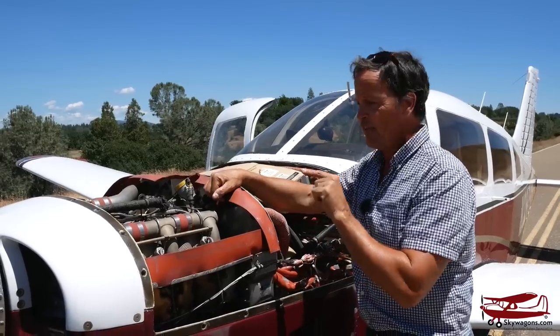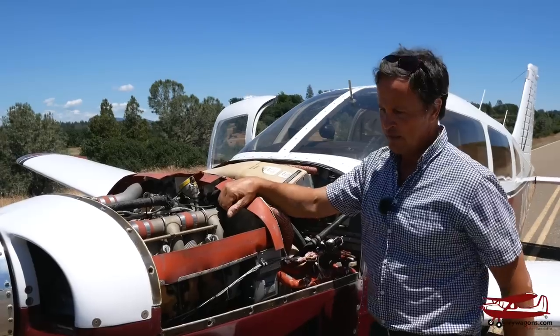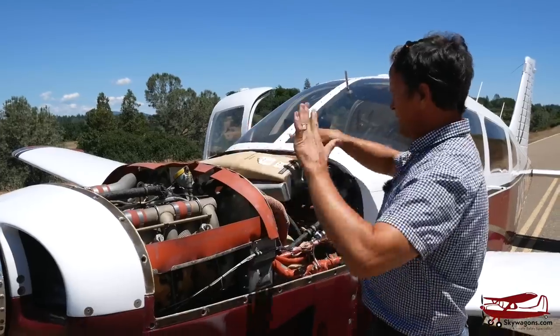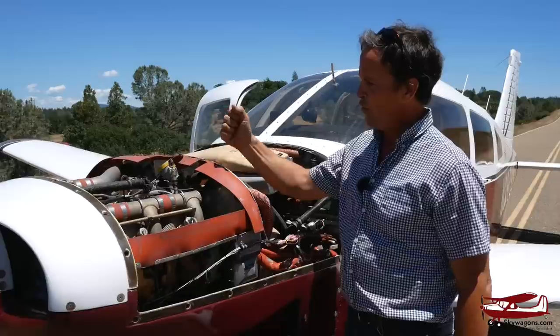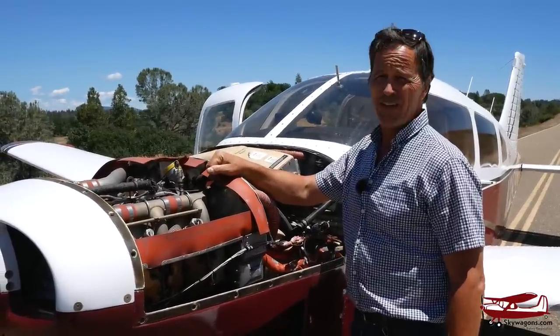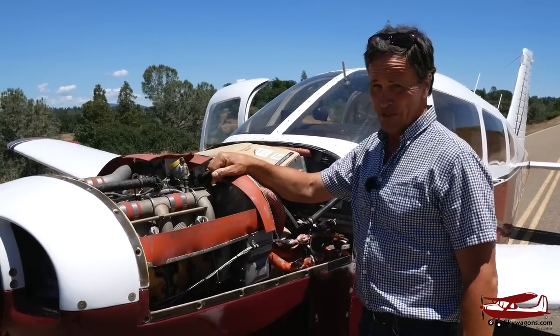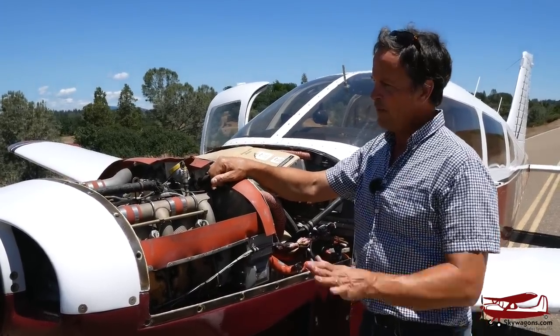And it gets there if you look after it, especially if it's intercooled and it's got a wastegate on it to protect the engine from the jockeyings of the pilot. Other than that, very conventional, hot starts, cold starts, everything the same. Fuel consumption is about, you could make this engine burn 11 gallons an hour. I mean, it's marginally more than the Lycoming, but it'll do it at 20,000 feet if you can go up there and breathe at that altitude. But very, very efficient, fast.